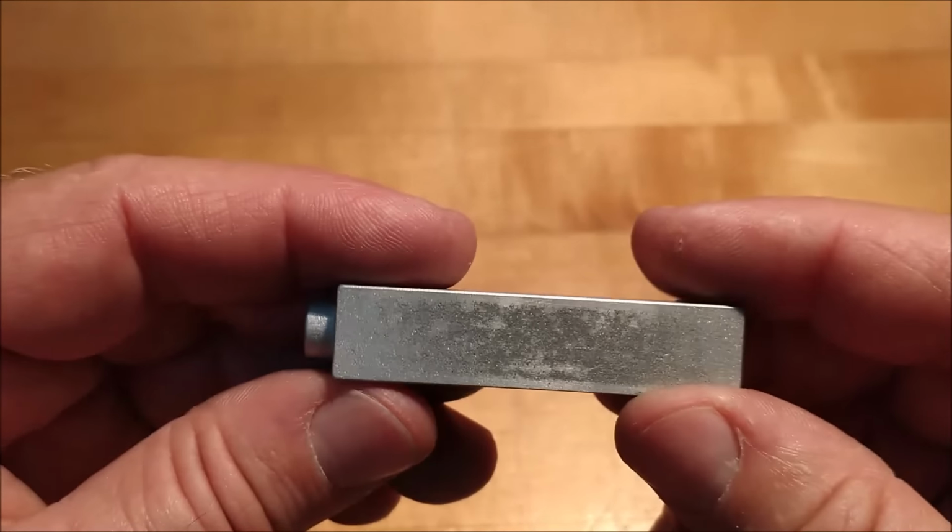Now at this point, I can start bringing these sides into required dimension of 500, and the lug on the end should stay central if I take equal amounts off of both sides. With the part now registering on the parallel sides that were just established, I'm going to sweep the jaws and come up with a center line.